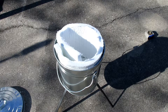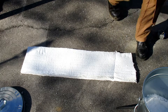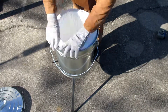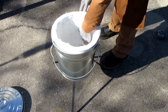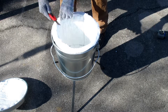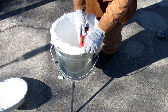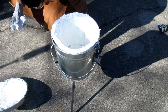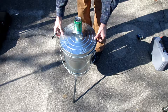I've cut away enough here to really line the forge twice and I've got a whole lot left, so if somebody wants some insulating wool, hit me up. I've cut this to the appropriate size and I'm gonna measure it out — you want it to overlap a little bit. You'll see that I actually get this wrong: once I get it cut down and think I have it exactly right, I put it in and end up with a little half-inch gap. I'm just gonna plug that gap with another piece of wool, which is fine since I'm eventually going to cover the wool in a Satanite mortar lining after securing it with sheet metal screws. You can see I've got kind of a press fit into the lid, and that's pretty much the entire lining done.